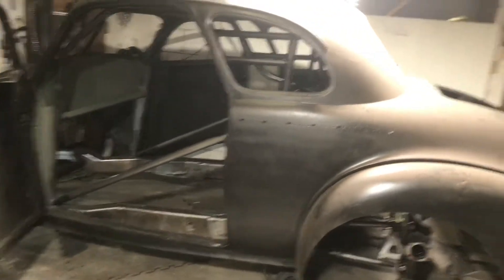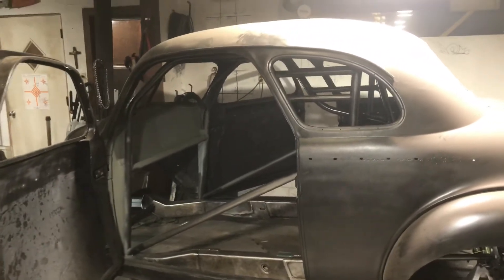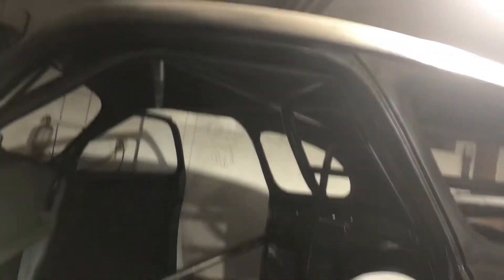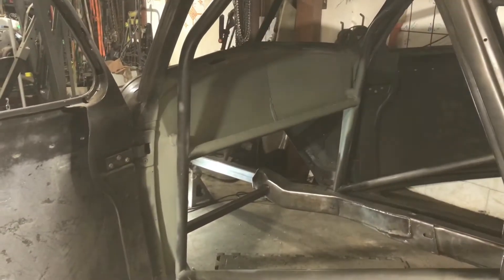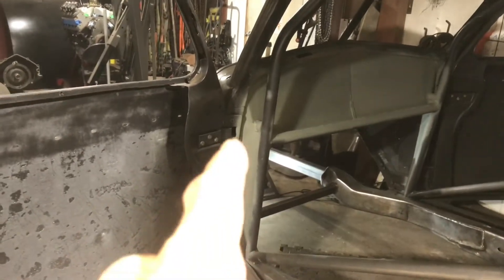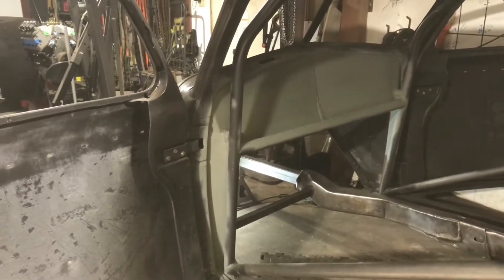It's come along pretty good. I've got the roll cage back in place, got it welded out the first portion of it, got it all painted — primed and painted — back up into place, and it's time to move forward. You'll notice the green primer — that's where I'm starting on the firewall. I've got both portions along the roll cage, between the door and the roll cage, welded to the roll cage and to the body as well.